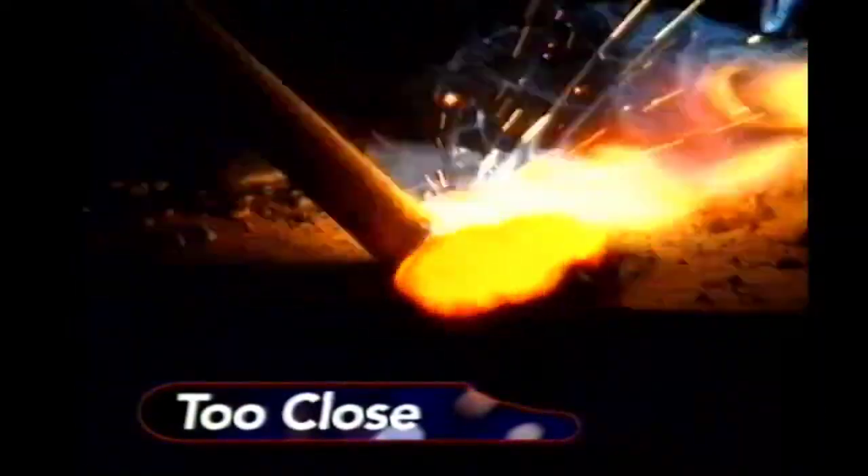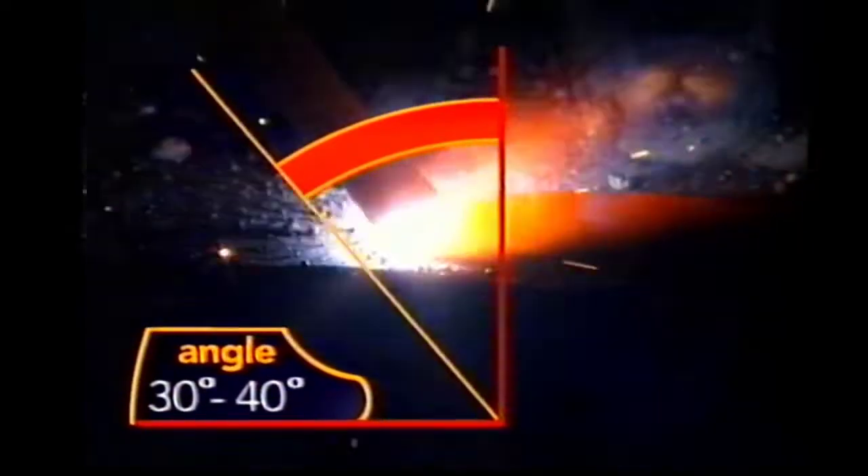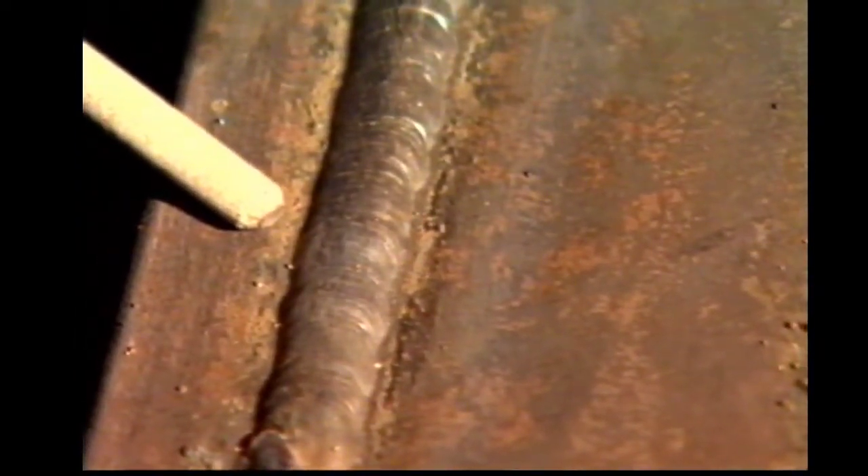Watch closely as we show you what it looks like when the electrode is too close, when it's too far, and when you have it just right. This is what you need to be seeing — the electrode about 1 millimetre from the job at 30 to 40 degrees. This is too close, this is too far, and this is what we are aiming for: a good consistent bead with good penetration. Looks great, doesn't it? Obviously it takes practice to achieve a good weld like this, but you can appreciate the possibilities from this brief introduction.